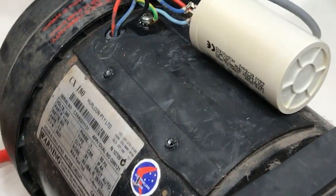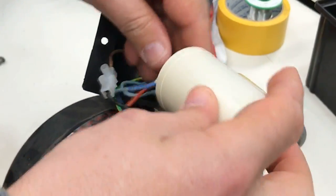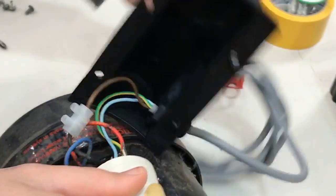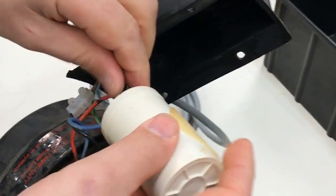We're going to open up our motor. Before we do the resistance measurement of the windings, we want to remove the cap. Should we have our motor unplugged at this stage? We should definitely have our motor unplugged. Do not do this on a live motor.